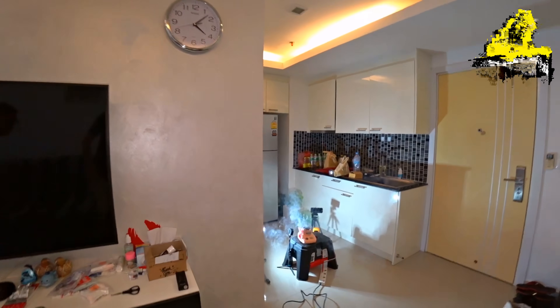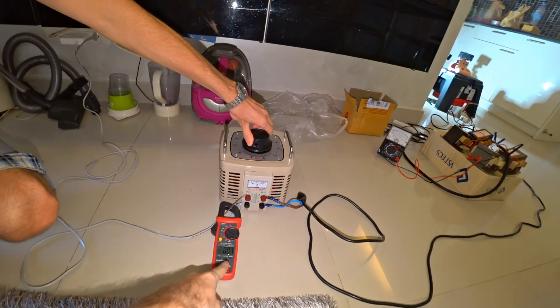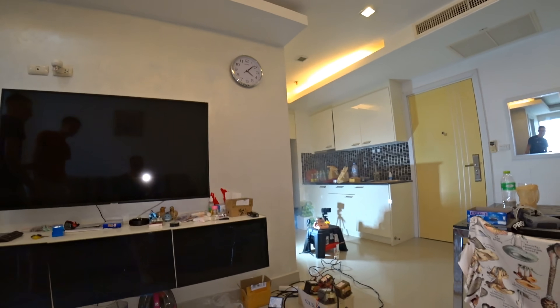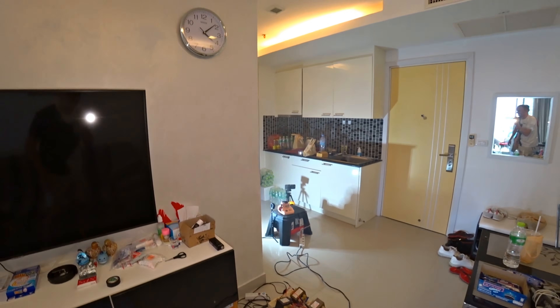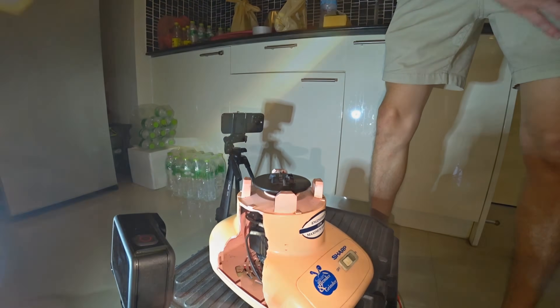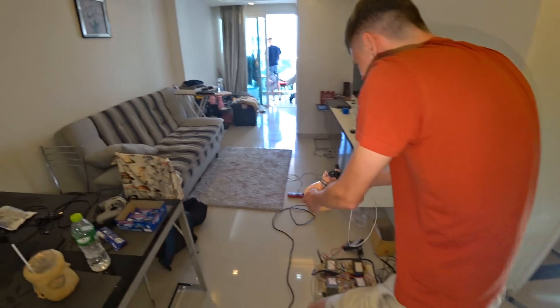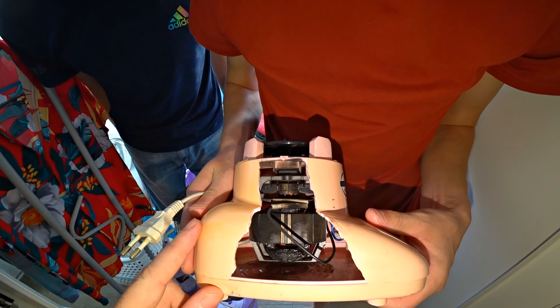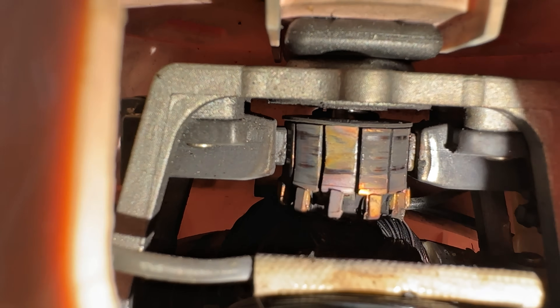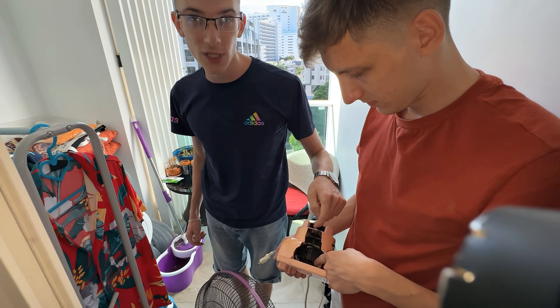We're on fire, it needs to be extinguished. We need to put it out — looks like something is on fire. Now we will apply voltage there — turn it up, do it again. It never dies. Is it a short circuit? Yes, it started buzzing — it's a short circuit. In short, we killed it. The winding burned in this — I saw it. We have dealt with the first one. Let's take it outside because it keeps smoking and smelling really bad. It just overheated, the wrap turned black. We argued about which would burn first — the winding burned all this time. Yes, it is the winding that gives such a pungent smell, because the brushes are not all worn out.